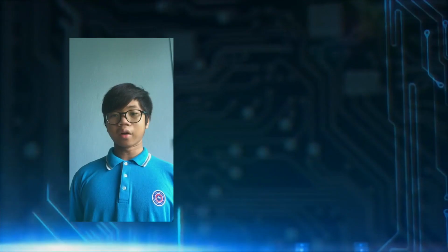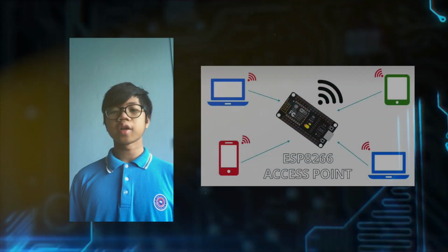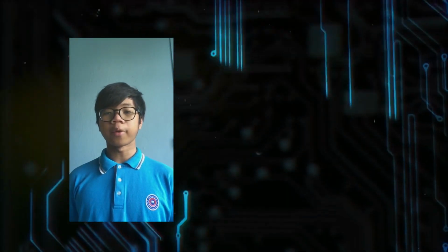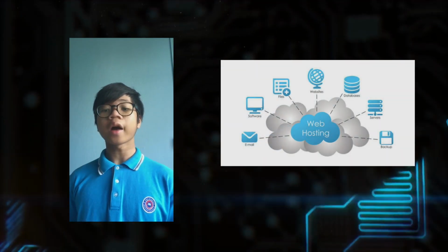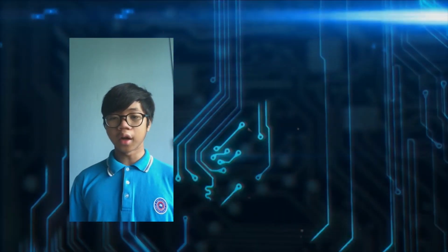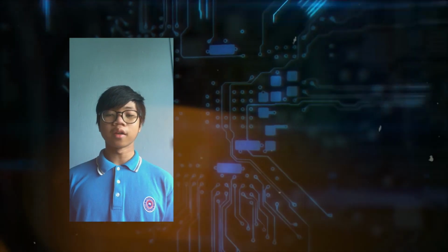In the programming part, we integrated and connected the NodeMCU to the school Wi-Fi. We have created a database in the cloud and programmed it via the cloud, and have learned how to control ESP8266 GPIOs from anywhere. This can be very useful to control a relay, a thermostat, or any other device remotely. We have created the buttons in a dashboard and assigned them to a board and GPIO number. Then, you can use the toggle switches to control the ESP8266 outputs from anywhere.